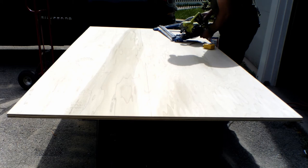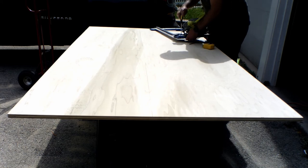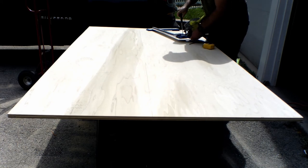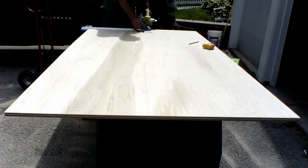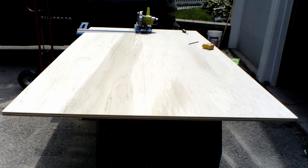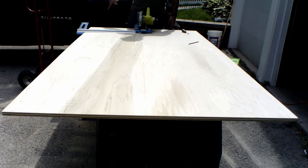And unfortunately, remember I brought up in some of my earlier videos some delaminating. So this is a tabletop. I'm using a poplar. There was a lot of delaminating with the poplar, so I'm going to recommend the birch. Unfortunately, birch plywood is about $55 a pop, and you're going to be wasting quite a bit here.